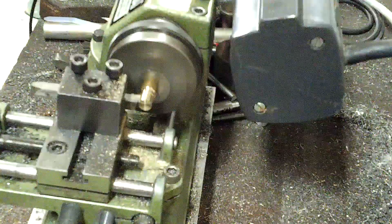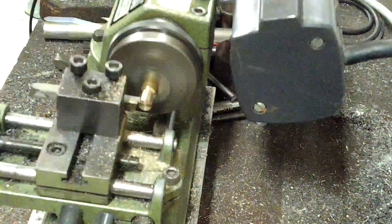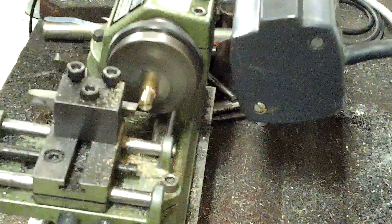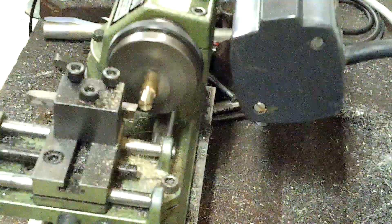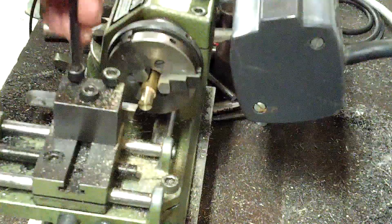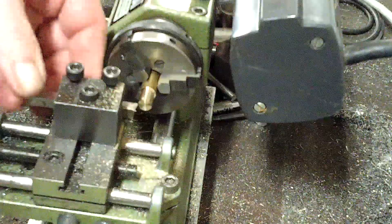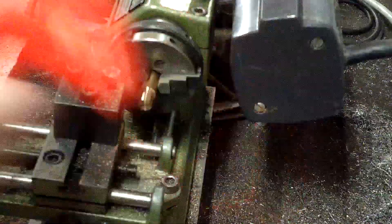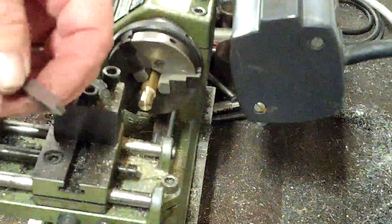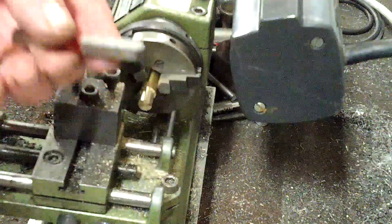You hear just the slightest of loading, but no problem whatsoever. I don't really feel brass is a challenge to machine on anything. It makes a very nice surface finish. So what I'm doing here is I'm going to go ahead and flip around to the rounded tool design — a very generous radius here.